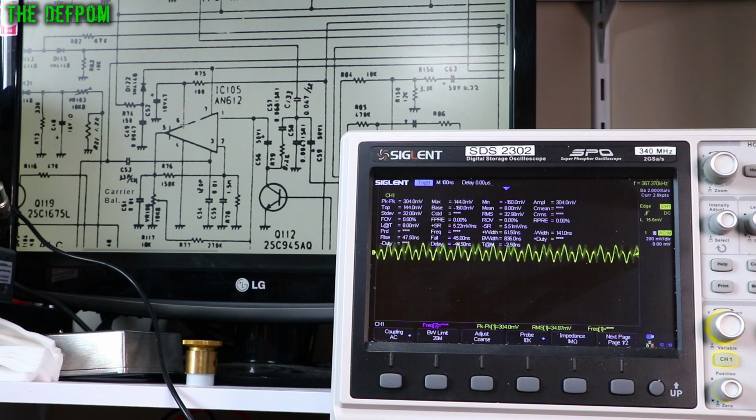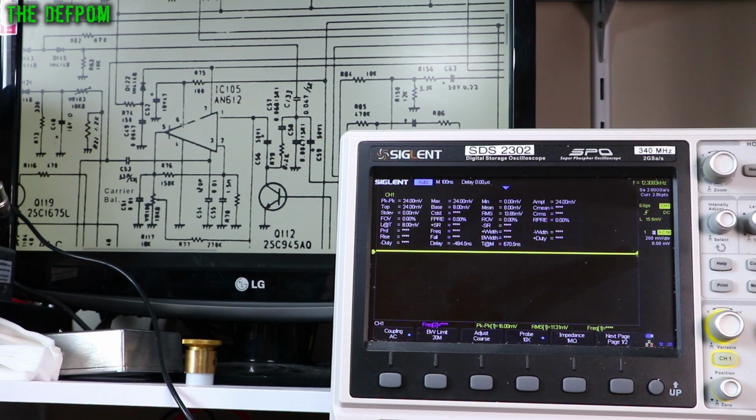So we go to transmit again. There we go. There's the IF going in. Alright, it's noisy, but you know, there's lots of stuff going on here. That's sidebands and transmit, AM transmit, FM transmit, and I've got obviously just general noise around the place. Okay, so it's working. So that noise that it was getting before was my soldering iron.